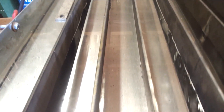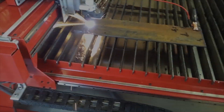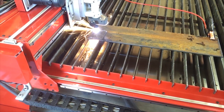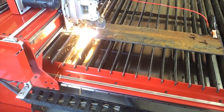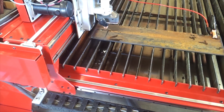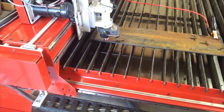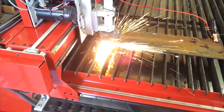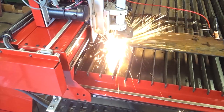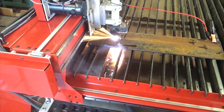Don't forget to ground the table as well — make sure you bolt the ground nice and firmly on there. Obviously there's lots of electricity around and you want to make sure it's safe. This is the first cut: we're cutting some quarter inch mild steel plate. The Powermax 45 is doing a great job and the water table is really worth the effort and expense — it makes a huge difference to the cutting environment.